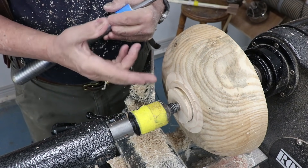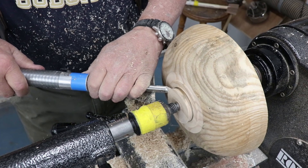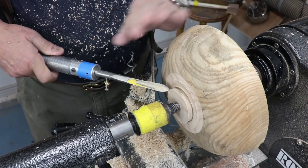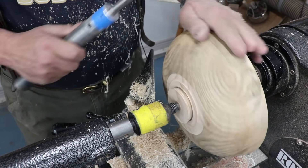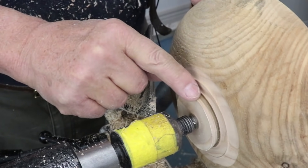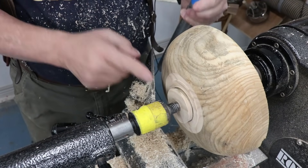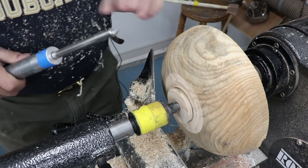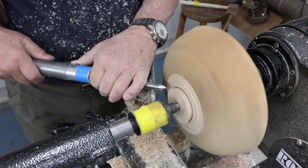This is cross grain, perpendicular to the bedway, so I'm cutting across the grain. If I cut in this direction I'm going to have a problem — I'll get a catch in that end grain. I was just scraping and that's okay. It ain't pretty, but you level off that surface and I'm getting to this area right here that wasn't all the way around. So let me do a push cut — come out here, right into this area right here, and I could probably complete this tenon just right now with my spindle gouge.